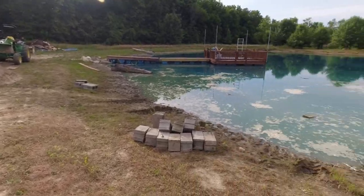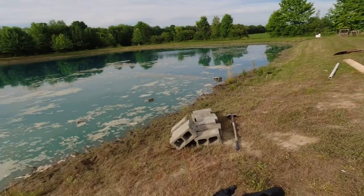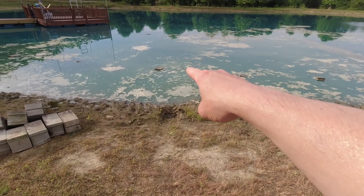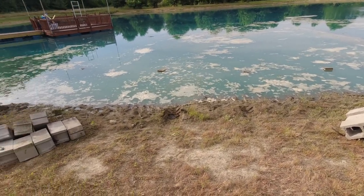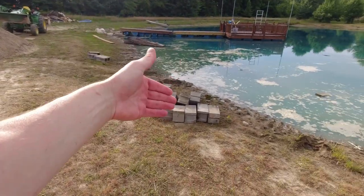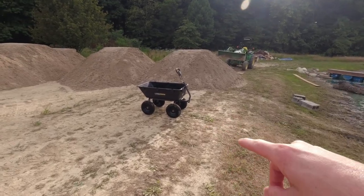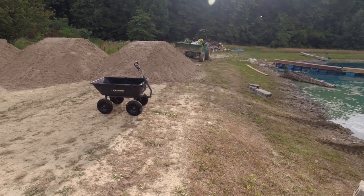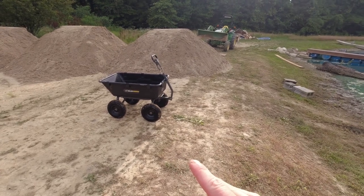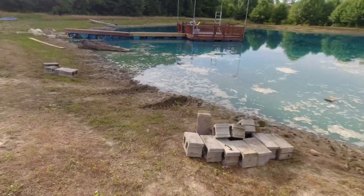I figured out how I'm going to do this. Some of you might ask why I'm not using the backhoe — the hoe reaches out 14 feet, and by the time I set it right here with the stabilizers and reach out, 14 feet is maybe just past that brick at best, so it wouldn't be getting me that much. I'd also have to pick up all the piles and move them close by, so not efficient. What I was doing: parking it, loading it with the tractor, kind of scraping it out with a shovel so I'm not overloading it. Take it into the water and that thing actually has enough buoyancy that if it's three quarters of the way full, it will float pretty much all the way out. Then I can dump it, turn around and come back.